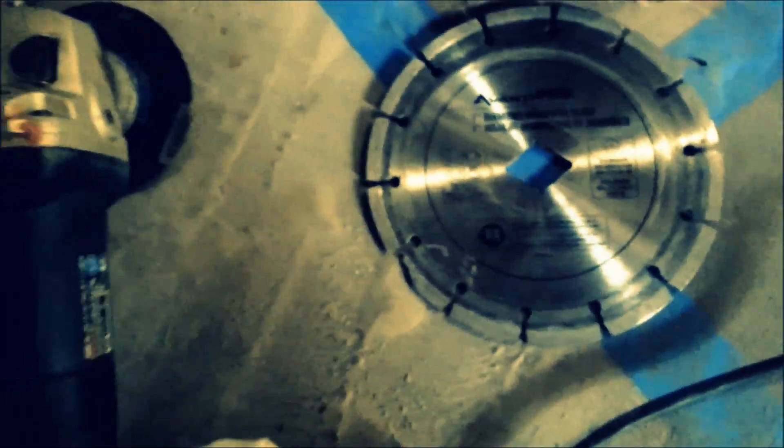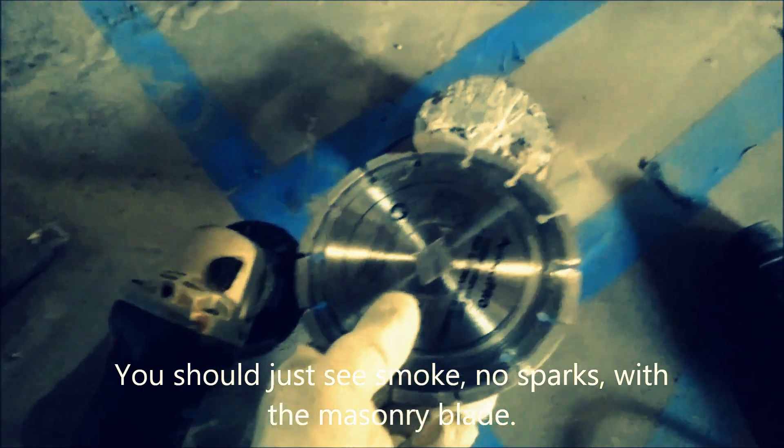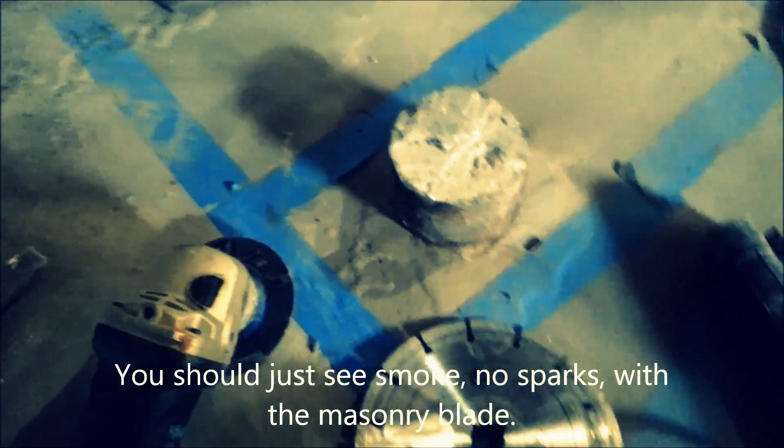Then pick up a seven inch diamond blade for masonry cutting. I went through so many sawzall blades and grinding wheels before figuring out what worked. Going around the steel takes literally about two minutes; going through the masonry again takes maybe two minutes. I spent an hour or more trying to get through it before finding this method.